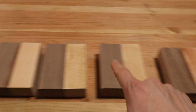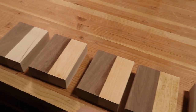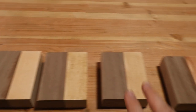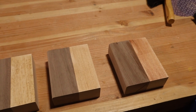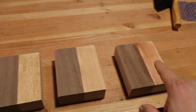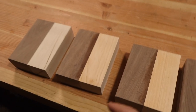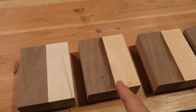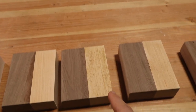So what you can see on these wet spots right here is the mineral spirit still volatilizing a little bit. I didn't want to go with something so volatile as, say, lacquer thinner, but the mineral spirit just takes a little bit longer to come off. So overall, on sanding it, it definitely got lighter. That was one of the things that I noticed all the way through, is that the stain is certainly at a surface level and doesn't go much deeper than that.